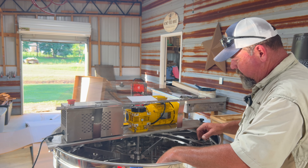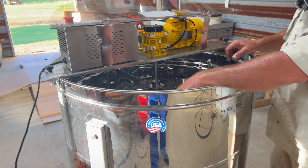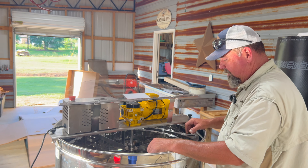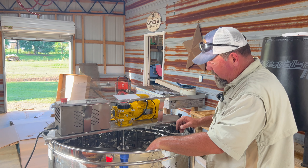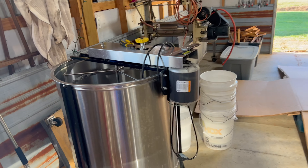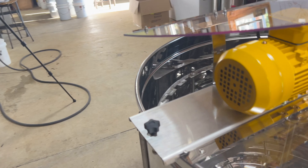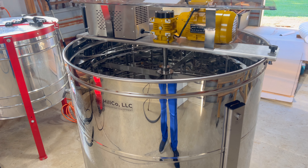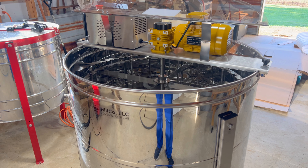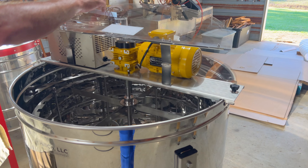We'll look at it from the bottom — I don't know if you can tell but there is a difference in height, it's ever so slight. It looks like down here we have a spot to grease the lower bearing. So man, I think they thought of everything — at least from what it looks like, all the things that aggravate you about extractors, he pretty much has taken care of. Here's something cool I just saw: your whole drive motor assembly, your inverter, your controller — two simple lock bolts basically to finger-tighten and they sit down on top of your top bearing. There's one pin to pull so this will all come off, and you can pull the extractor basket out if need be to clean it really easily. They're not always like that — it just seems like there's a lot of thought put into this design and it's pretty impressive.